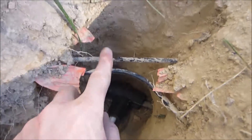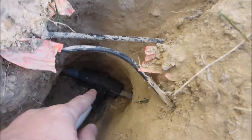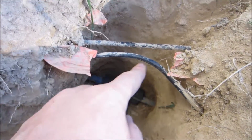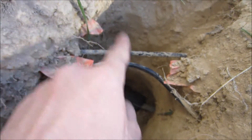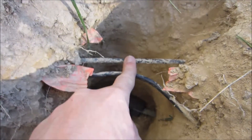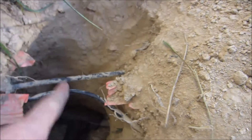You can see here these are two Cat5e lines. The electric line — 20 amp GFCI — is just under that water line. I was digging and I hit these first; I had forgotten that these were an afterthought, so they're only a few inches under. I'd already started covering.